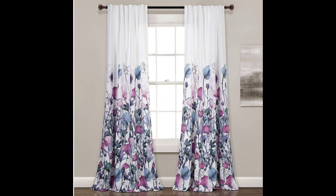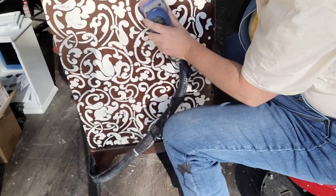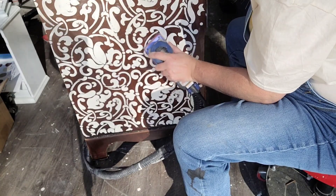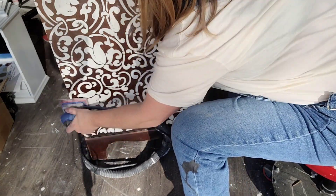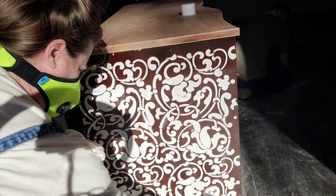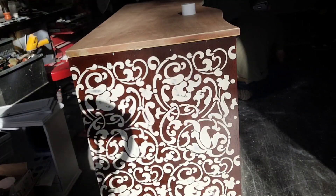Here's where I landed. If you remember from the intro, these are the colors my sister chose for her nursery, and we're going to be using this for our color inspiration — pulling the shades of purple from these draperies. The first thing I need to do to get my stencil ready to accept paint is sand it down using my Surf Prep sander. I believe I had 120 grit on at this point, going over lightly just to remove any loose bits and uneven spots. Next I'm going to give my piece another coat of shellac to seal the mud so it doesn't reactivate when I brush paint over top.